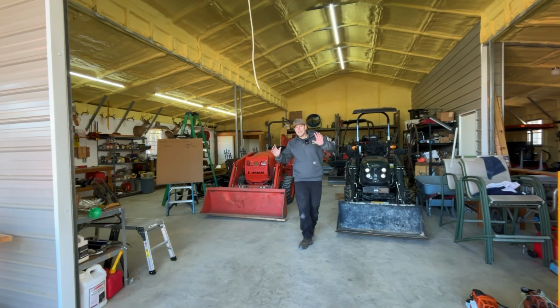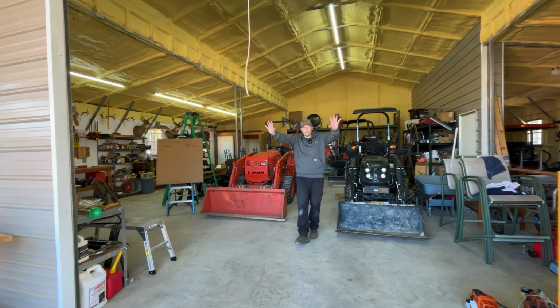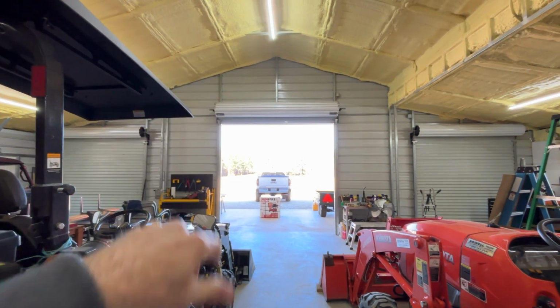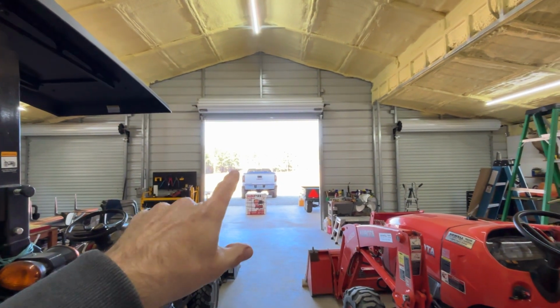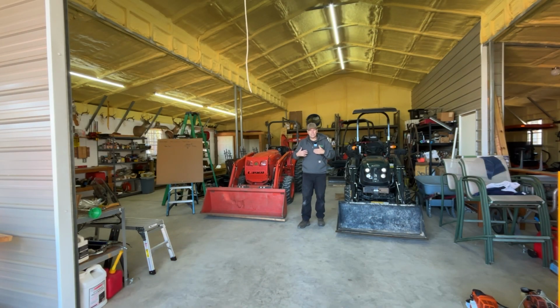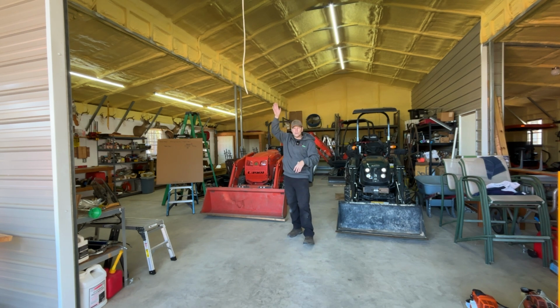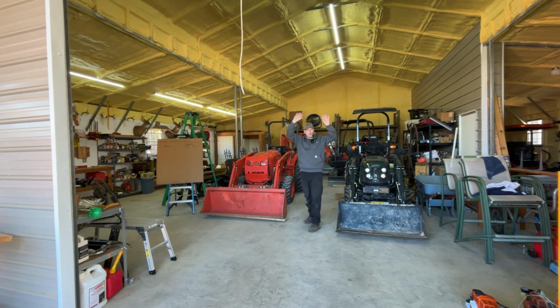It's 44 by 40 inside here. The camera's in the threshold of the 10 by 12 roll-up door, and that whole north-facing wall, which is always shaded, does not have any sort of insulation on it at all. It is just sheet metal. But because this shed was primarily designed to keep out solar loading, we got 2 inches of spray foam on the whole roof deck. We have 1 inch on the east wall, but we also have OSB on the east wall for an additional radiant barrier, and then 2 inches on the south wall because that one heats up a lot.